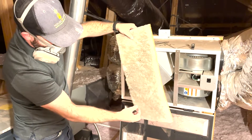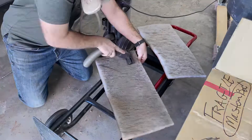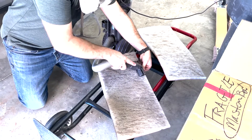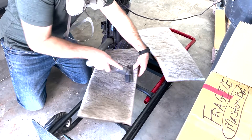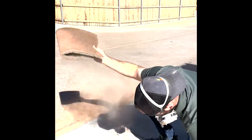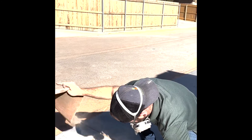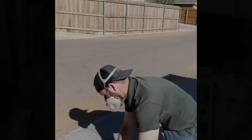That one was not as bad, but still pretty bad. Once we vacuum them and get all the dust out, we'll put them back in. As it says, change those every three months — otherwise all that dust is going to be clogging up the system and probably bringing it back into your house.